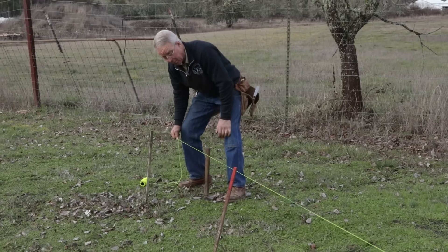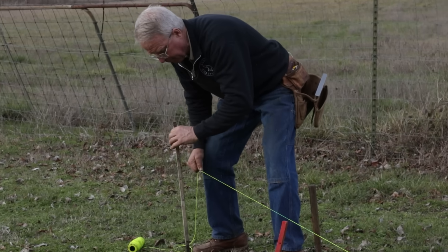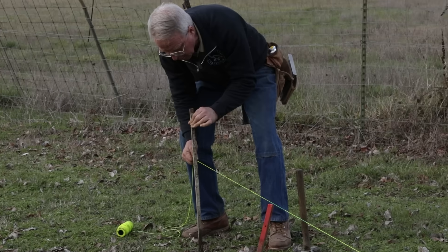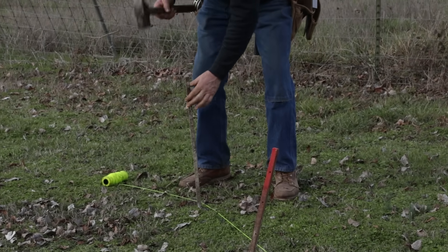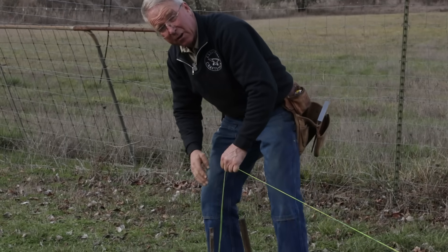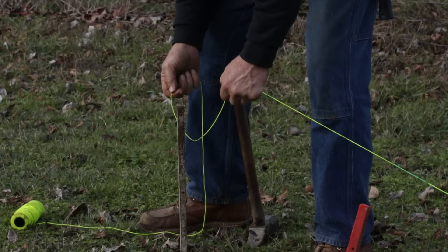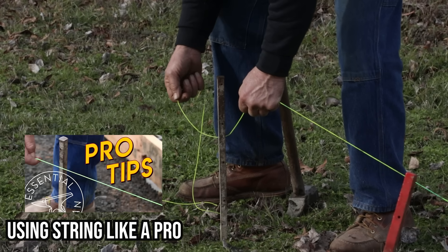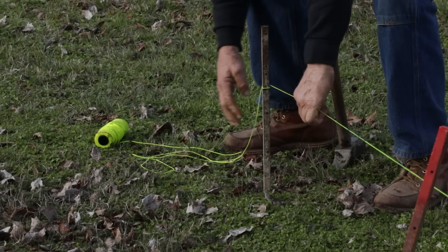Now this is way longer than it needs to be, and that's good. We're going to drive a stake out here to receive it. One way to make a stake plumb is to let it hang from between your fingers, and then try to maintain that attitude as you put it in the ground. Now to stretch a string on a square stake, you put what I call a binder knot — or just a hitch really — by putting it against the side of the stake that you want it to be referenced off of, putting one wrap around the stake and pulling it.